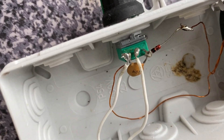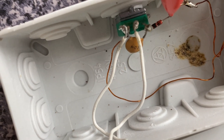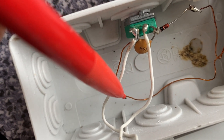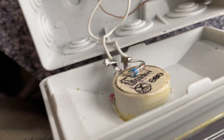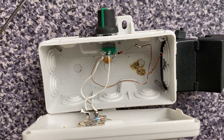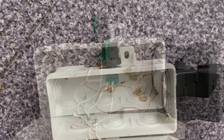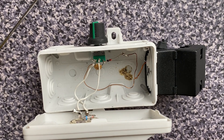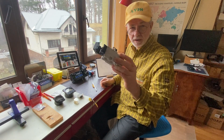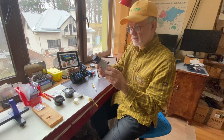Inside the box, all the components are actually mounted on the pins of the variable resistor: the rectifying diode, the filter capacitor, and the wires from the transformer. The protection diode is mounted straight on the pins of the meter. The box is spacious enough to put whatever else you want in it — maybe a small PCB with something, or just a small sandwich when you go to the field. The box itself could be any box of your convenience; in my case I bought a simple electrical wiring box from Home Depot.